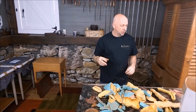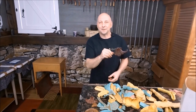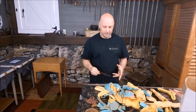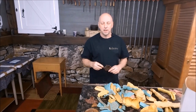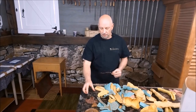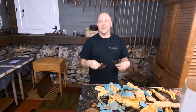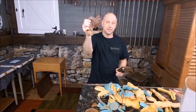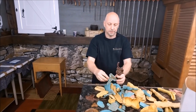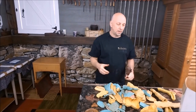So what happens is we get a lot of jobs in here and you come across a lot of furniture that's missing a piece, missing a part. And those pieces that are missing something, you can get those for a lot less money. It seems like a tall mountain to climb to remake these things, but really casting them is all simple stuff. When we're pricing jobs for refinishing, typically the money is not there to re-carve and reproduce something like that out of wood. So we just make molds and cast the piece out of a mold and color it. It becomes an exact replica — typically far better than I personally could ever carve anyway. This gives us an opportunity to do it at a really reasonable price.